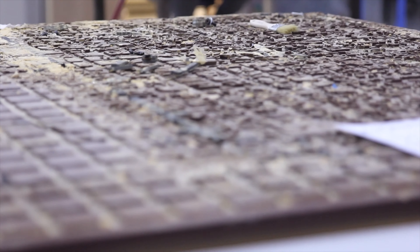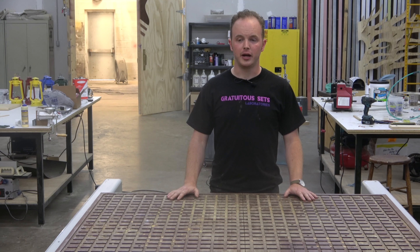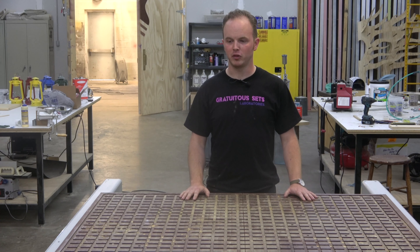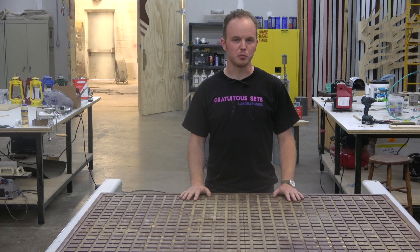From there down it's really going to be all new components — new breakout board, new power supplies, everything straight off the shelf. This machine has a really nice giant vacuum table where you can hold down sheet material and all sorts of things with this giant vacuum pump we've got over in the corner of the shop. That vacuum pump is actually going to have to have some work done to it — it needs bearings and possibly other things, so we may have to open that up and see what it looks like inside. Then this giant phenolic top is going to have to be replaced because it does have a fair bit of damage. We're going to be sourcing a piece of one-inch-thick phenolic from somewhere and actually having it milled with a checkerboard pattern on a larger CNC machine so that the channels for the vacuum will function properly, and we should have a brand new surface to be working on.